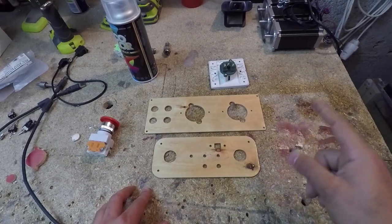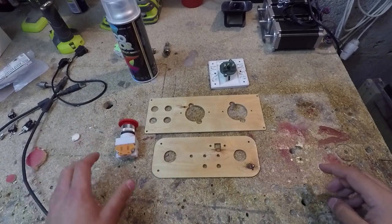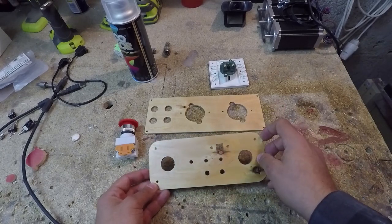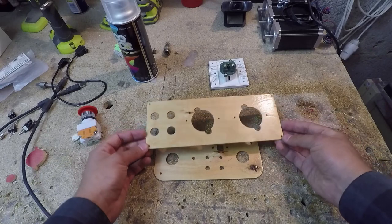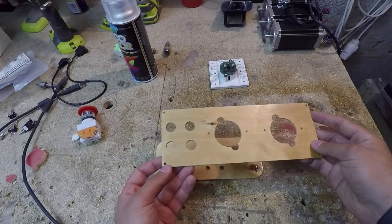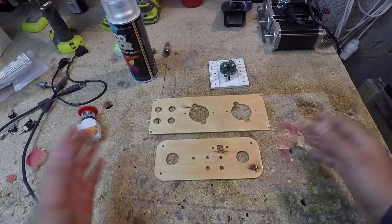There are two things I want to share. Number one: never trust anything you read on the internet. I was too lazy to go to the basement to check the dimension of a fitting, so I looked it up from the vendor's site and it said 30 millimeters, but it was actually 32. So those didn't fit and I had to use a Dremel to enlarge the holes — now they're not as nice and round. Number two: double-check your coordinate system in the CAM software, because I didn't. Even though I set it correctly on the machine, the software thought it was about three millimeters to the right, so I have two or three millimeters missing on one side. I had no materials left to redo it, but it could have been prevented.